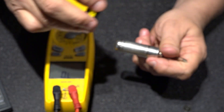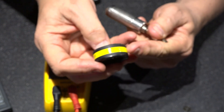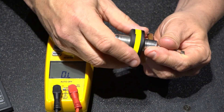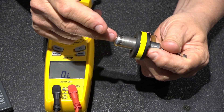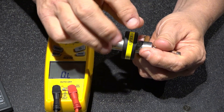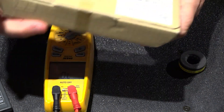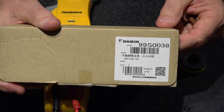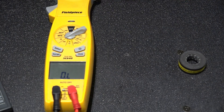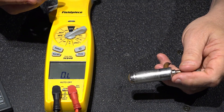The one that works with the Daikin product is this little magnet right here. It's got markings that show which way to turn for open and which way for close, so I can slide it over and open up a valve and see if I can get it unstuck. If I can't open it with this magnet, I'm probably going to have to replace the valve. Through Daikin parts you can get this part - it's a fairly expensive little tool, but your dealership or supply house will be able to help you out with that.